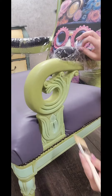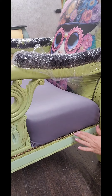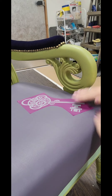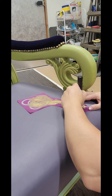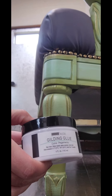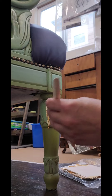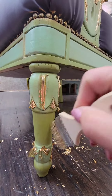I'm at the home stretch now and the last thing I need to do is add some gold accents. Eternal — this is my absolute favorite gilding wax from Redesign with Prima. I'm also going to use the Steampunk stencil from Dixie Belle. One of the key parts of the Ugly Duckling Challenge was to have a theme of sparkle, so I wanted to make sure I added gold not only to the details but also a little bit of that gold gilding wax to every nail head trim. I just brushed it gently over with the tip of my finger and then I used that same wax and a waxing brush over these silkscreen stencils. The final bit of sparkle came from some gold leafing — I applied gilding glue to various details on the legs and on the side and then stuck gold leafing sheets on with a cheap chip brush. After a couple of minutes you can just brush away the excess and leave behind the sparkle where you had glue.